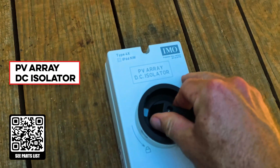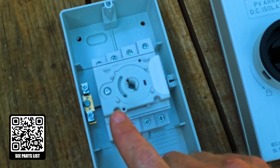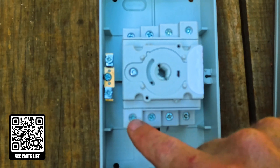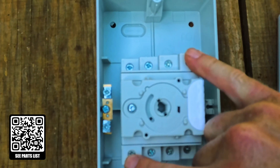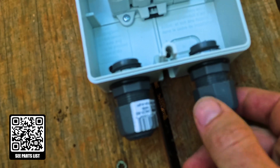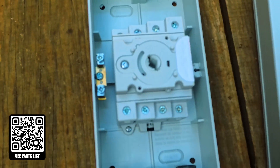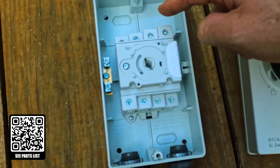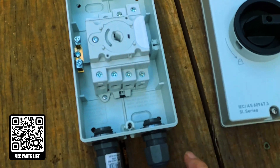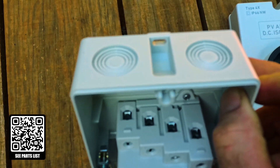The DC isolator allows you to turn the entire array on or off and it provides an actual DC disconnect. One thing to point out real quick: if you've got this unit, you would almost think that this one would come through to this one, but if you're connecting the wire in right here, you're actually going to go back over to this one here. It's kind of like this, but read your instructions and make sure that you do it right. I've also got some watertight connections down here that the PV is going to go into. I decided not to go out the top, but rather come in here and then come out here and probably loop back around here.